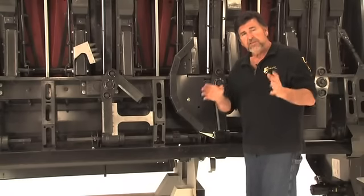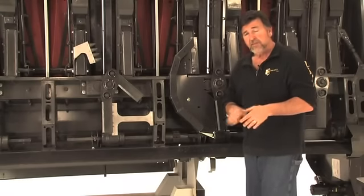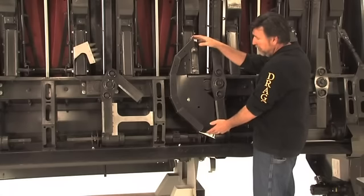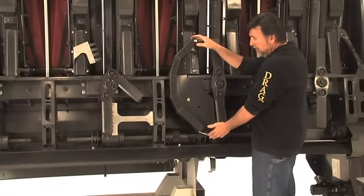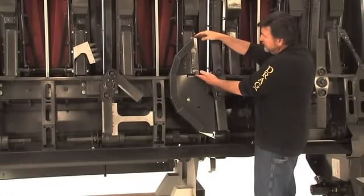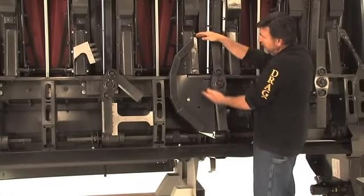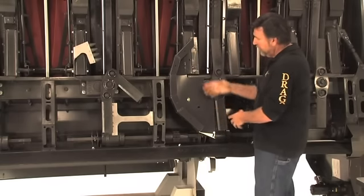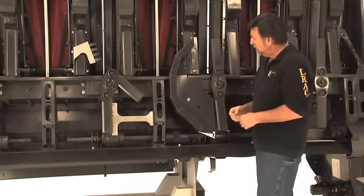The next level in residue sizing we offer is something we call the Turbo Chop Shield, which really incorporates both the single stationary knife and a half-moon shield to hold the plant material in the chopping area longer to give you more residue sizing.